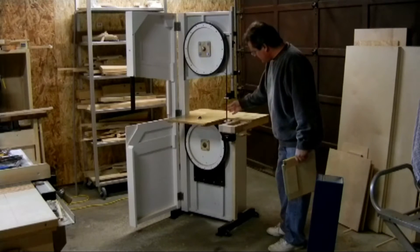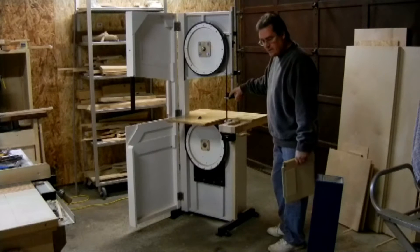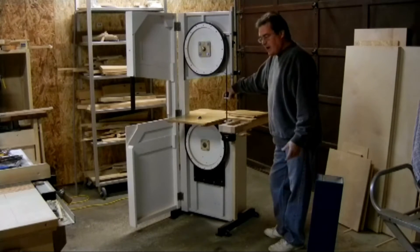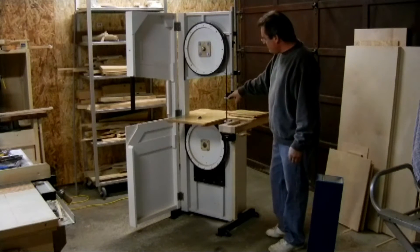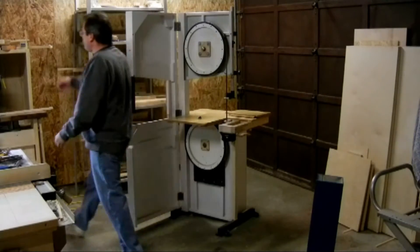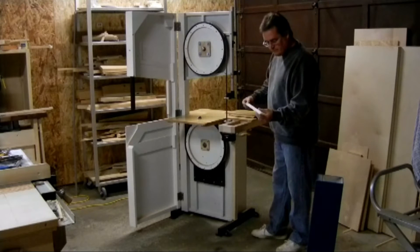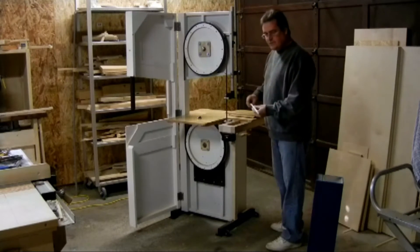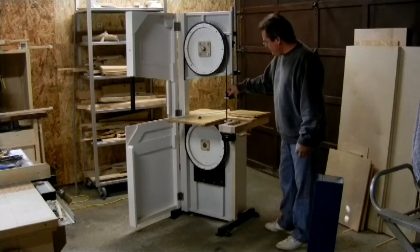Now what's different about this blade guide system is that I tried something a little bit different here. I've used the ultra high molecular weight plastic that you can buy — it's used for guide bars for chop jigs that would ride in a slot on a table saw or whatever. I just cut it into short pieces and clamped it in here. This blade guide is made of steel that I welded up, and it works really well. The material is three-eighths of an inch thick and three-quarters of an inch wide, and this was 24 inches long — something like five bucks from Lee Valley. I use that for the upper and the lower. And the thrust bearings are just inch-and-a-quarter bearings that the blade rides against.